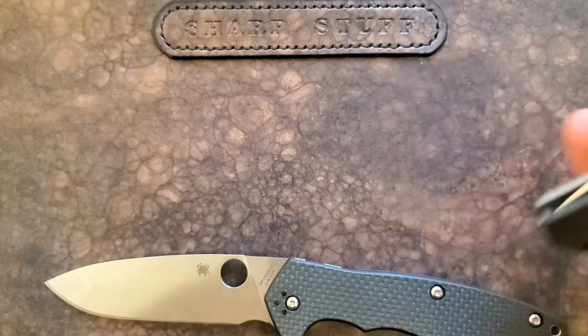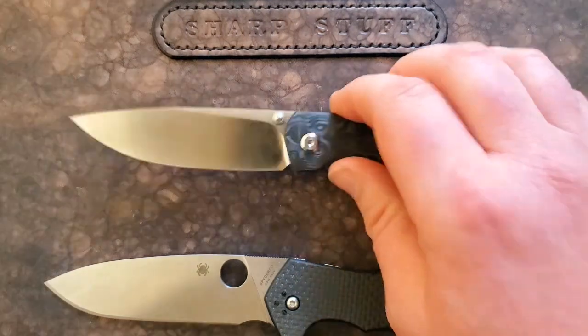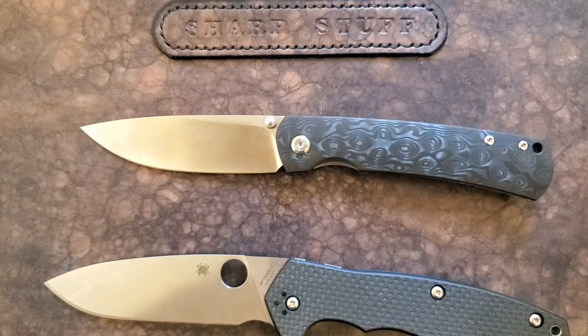The other knife I want to bring in is the Monterey Bay Old Guard. Really beautiful looking knife — I love this design and I like it more now than when I first got it. People have complained, and rightly so, about the detent being insanely strong. However, it's much better now because when I initially took it apart to clean and lubricate, I could clearly see and feel a full burr all the way around the detent hole. So I just took some sandpaper and gently cleaned off that burr, very carefully so as not to mess up the finish.